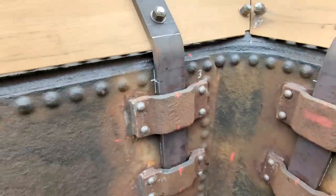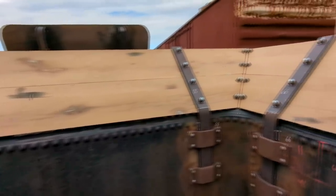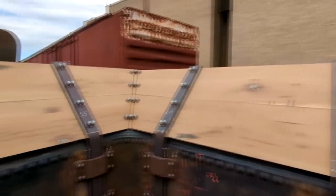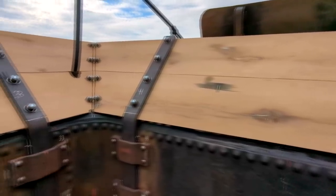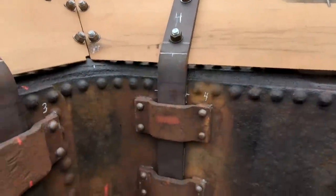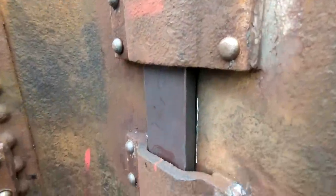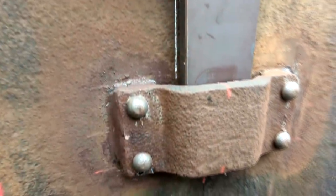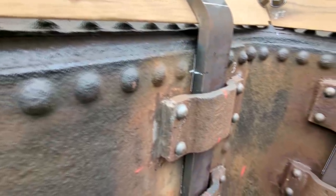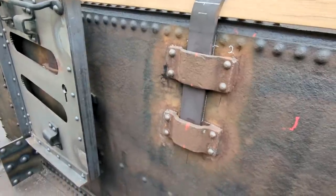These are the stake pockets. The point of them was that crews were never really happy with the coal capacity, so railroads added these stake pockets and wooden sides so the tender could hold more coal. When we got this tender it was half put together — reportedly for the 1939 World's Fair — and these stake pockets were all crooked and weren't welded correctly; they didn't even have the rivets in them. What we did was weld them but hide the welds to make them look like they're riveted in place. They're actually welded and a little stronger — partly because I couldn't get to the back side to hot rivet them, and also because riveting might have shifted them slightly out of alignment for what we needed.